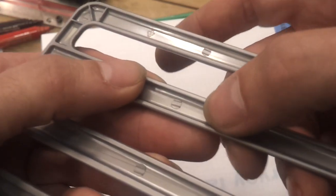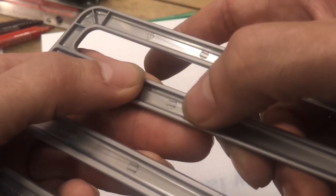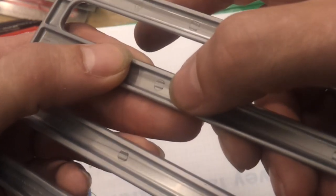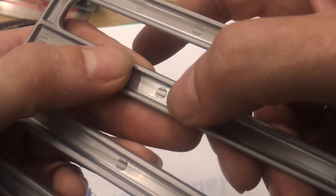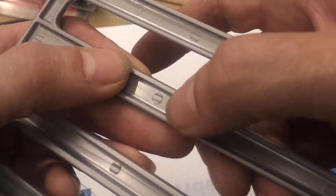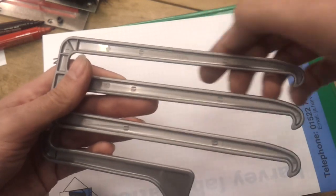Although that will guarantee the moulding pulls this way, it's going to make it difficult to eject, especially in a rigid material like this polystyrene. So in order to get around that problem and retain the central parting line, what they've got on the back here are some ejector pins with a couple of tram lines across them — these are grab pins. You'll also see a crosshatch waffling pattern occasionally being used, but the idea is that the plastic will over-mould onto that pin and just hold it in place.